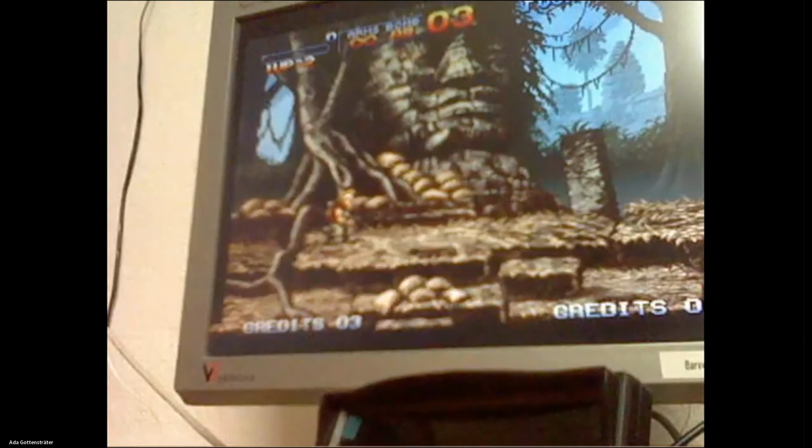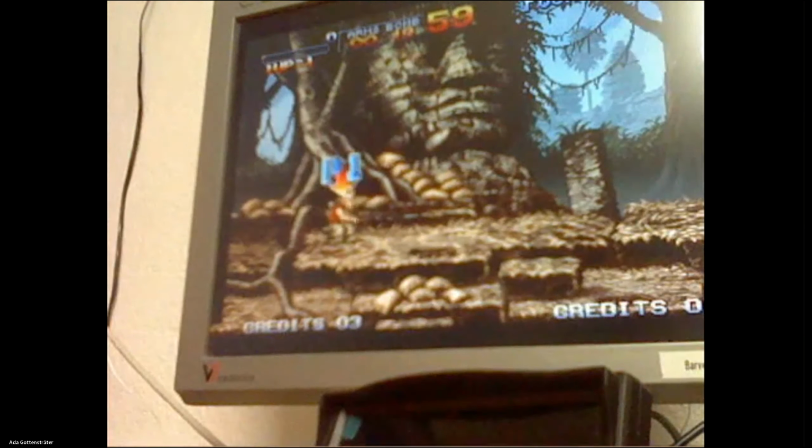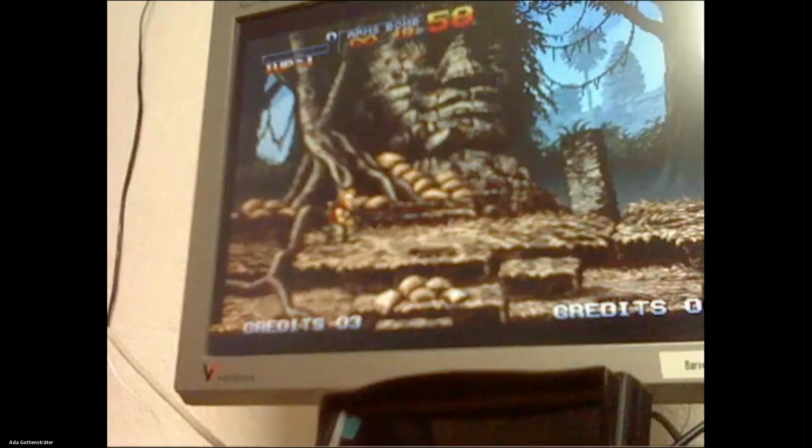So you're saying in HDMI, the amount of blanking doesn't matter. Doesn't matter unless you connect some sort of weird adapter. Maybe some capture devices will also be strange, but generally it doesn't matter, unless something expects some standard. But the monitor just scans in the data, then waits for the vertical refresh and rescans it again. And probably doesn't even care. I just add vertical blanking rather than horizontal blanking because that's probably less problematic, and it's also generally easier to adjust the clock frequency with my line-based video.